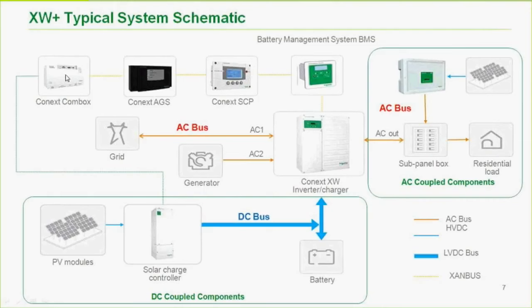and it goes to this thing called a COM box, which gives you the ability to program the inverter and actually all the devices in the network via your PC in a much easier fashion than you can from the system control panel. Actually, anymore, in my own system, I would probably use this over this, although it's nice to have the control panel as well. It also gives you the ability to tie this out to a router and get out to the web and do web monitoring on our new Conext Insight web portal. You can actually browse directly into it and even do configuration and monitoring directly into the inverter, or into the system, I'll say. So that's the COM box.